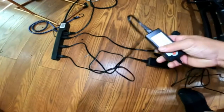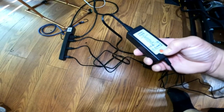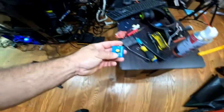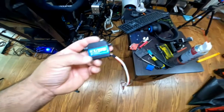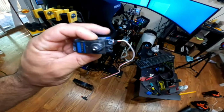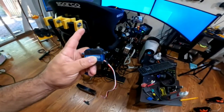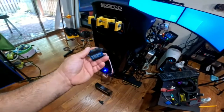Now I'm gonna show you how to connect everything. First you're gonna need this power supply — you can adjust from 15 volts down to 5 volts, so I'm running at 6 volts for each servo motor. And then you're gonna need a 35kg servo motor. I tried before with a 25kg and it's not strong enough. This one is really powerful. I kind of damaged this one the other day but it's still working — just to show you how to connect everything. Let's go and put this together — it's really easy and simple.